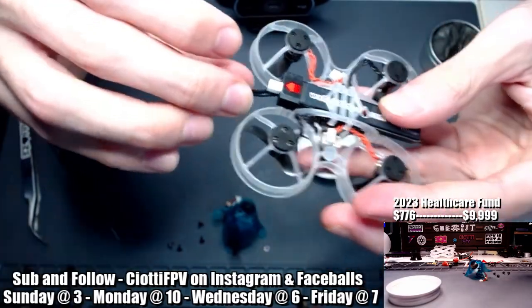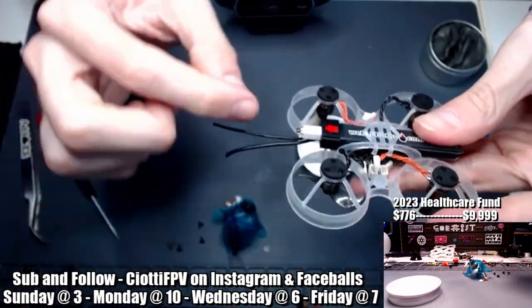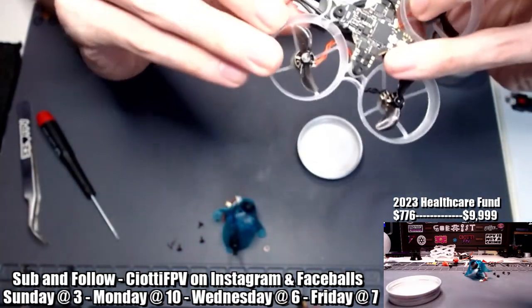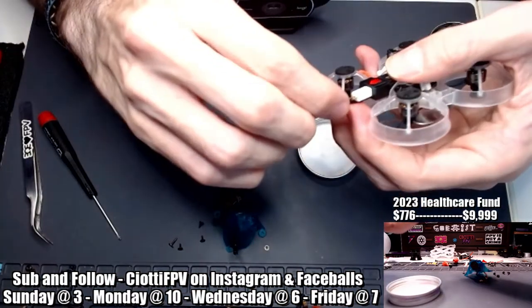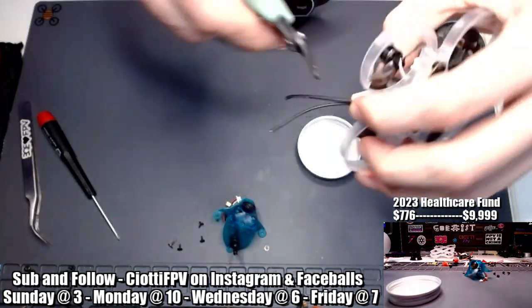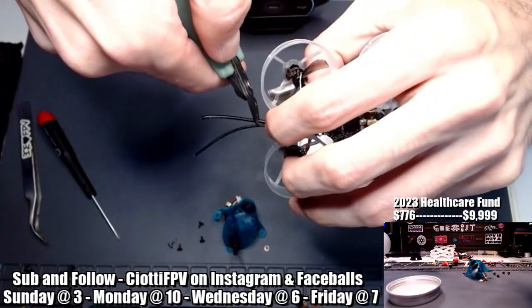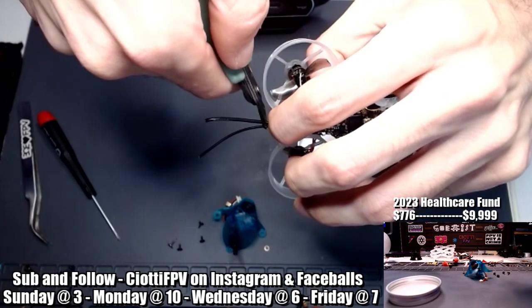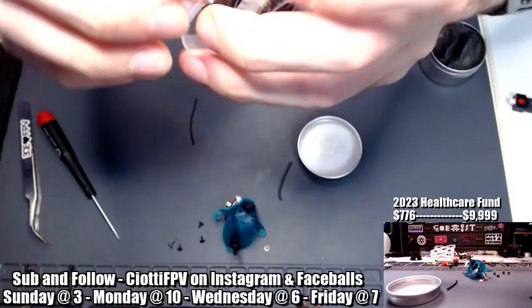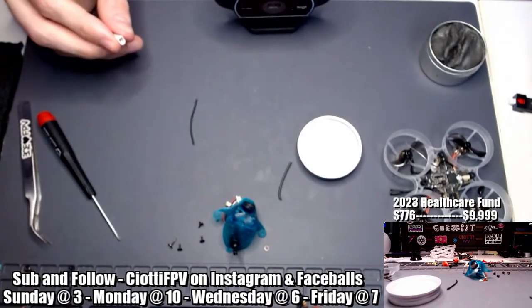And so now we can take our BT2.0 lead, put it on here, and now we can look at exactly how much wire we need. And then we want to cut them a little bit beyond that. We want to have a little tiny bit extra. So line it up here where it needs to be, and then just put my flush cutters a little bit beyond that spot and cut them down, and now we've got as short as possible of a wire run, and that's going to save us even more weight.